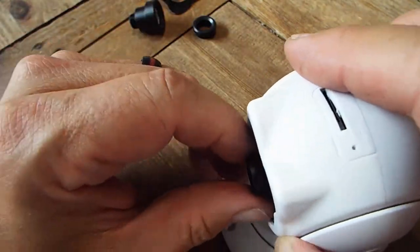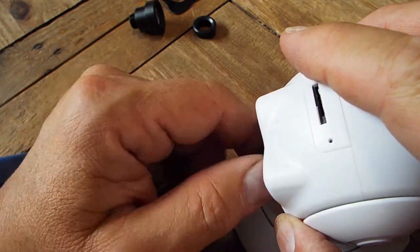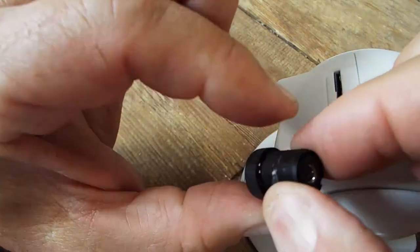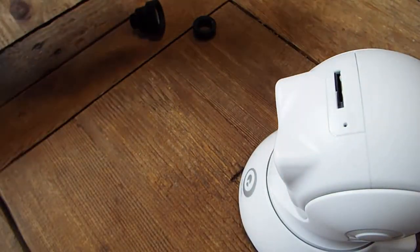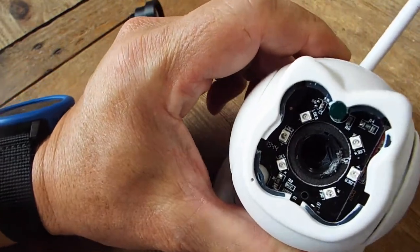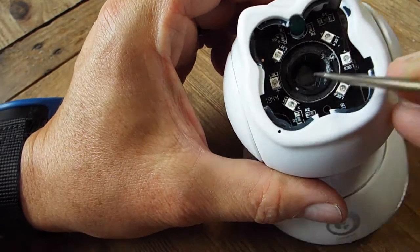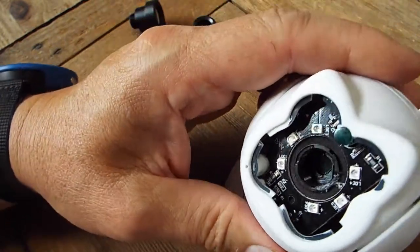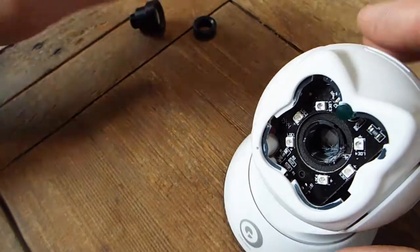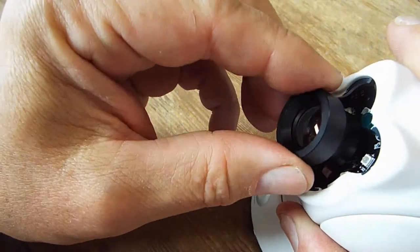Twist the lens a little harder and it'll start twisting off. You don't want any of the epoxy to fall down into the camera sensor, so just tilt the camera head down. There's the factory lens. You'll notice in the factory lens there's no infrared filter, because this camera is night vision capable with the infrared lighting — they want to be able to pass infrared to the sensor. There's a filter assembly inside the camera with a little filter that moves back and forth that a solenoid activates. When the night vision is on, that filter is out of the way; in the daytime, they put the filter in the path. Here's the new 22mm lens.